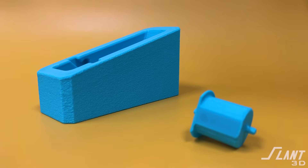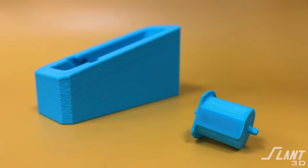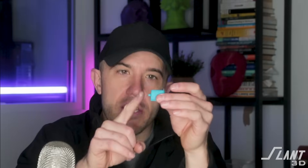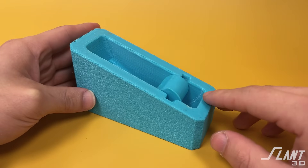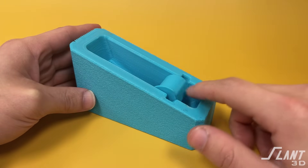That's pretty simple and doesn't have any effect on the function of it, because it's going to go into another circle and having a single cropped edge doesn't really affect anything there. But this does make it very printable because now it has a nice surface to print on. However, you still have the issue of these actual overhangs, and we can't fillet or chamfer those because they need to be able to sit deep into the grooves of the main body.